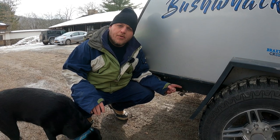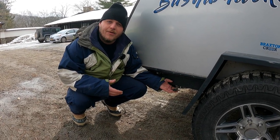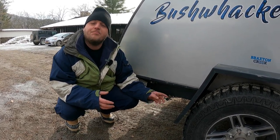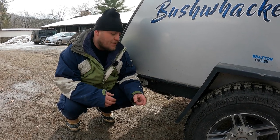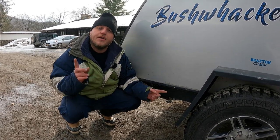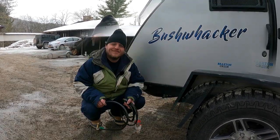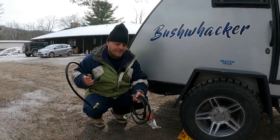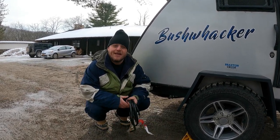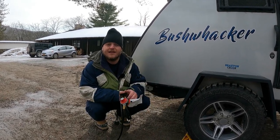These low flow ports are really convenient, but three out of four of the problems people have contacted me about have to do with trying to regulate the gas a second time. This is a low flow port — the gas pressure has already been regulated. So if you're going to connect a device to this, like a generator, a fire pit, or a grill, you're going to want to use a hose that does not have an extra regulator. You can't regulate the propane twice. Read your owner's manual — this port is not going to work if you try to add a second regulator to it.